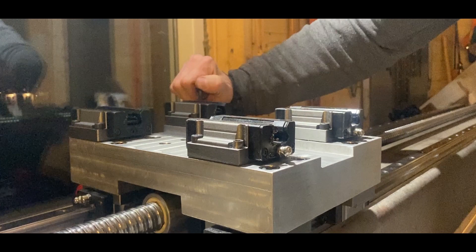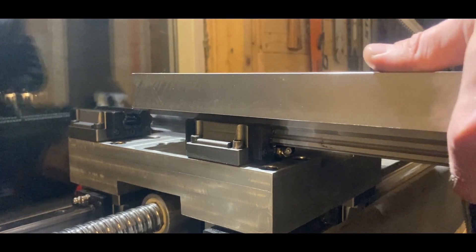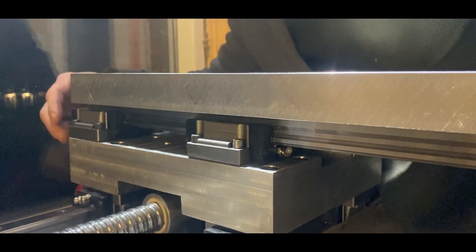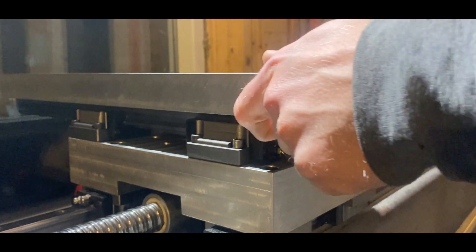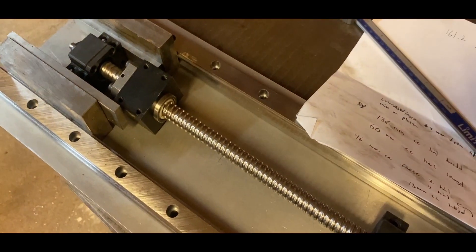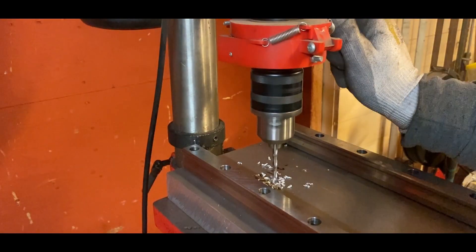It was a really close fit but I had to loosen the screws for the bearings as well. I just needed to give it some persuasion — and there we go, that feels really, really nice. Once they were all aligned I could then tighten all the screws. I used gauge blocks again to get the ball screw centered perfectly in between the linear rails, taking into account the length of the shaft coupler when positioning the ball screw. I then carefully marked the holes using a drill bit that matched the inner diameter really well, and headed over to the drill press once again.